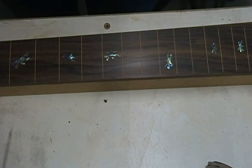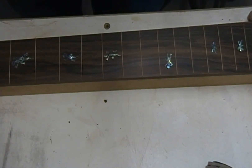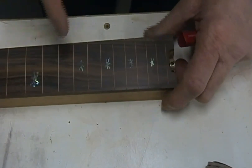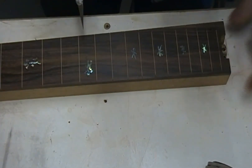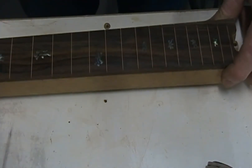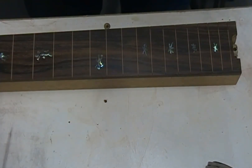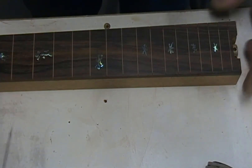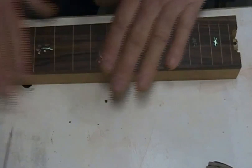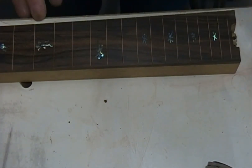I was up to about 220 and I was cleaning the slots with my X-Acto knife. I got up around this end somewhere and didn't even realize I'd done it, but I scratched the board really deep with my razor blade. When I dusted everything off I went - oh crap. So basically I went back down to 80 because it was fairly deep and I couldn't pull it out with finer grits. I got it all sanded out again. I'm now sanded out to 320, checking my radiuses and straightness all the way along, and everything is really nice and very clean.